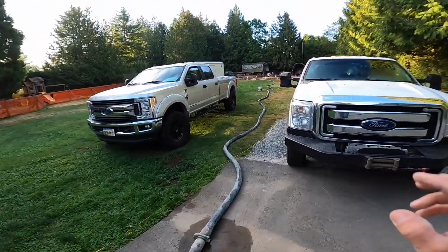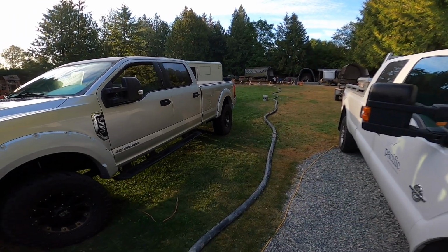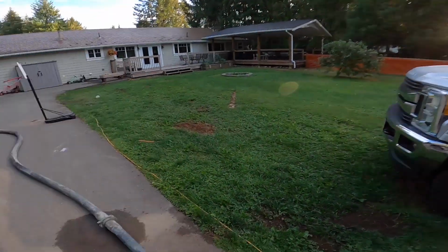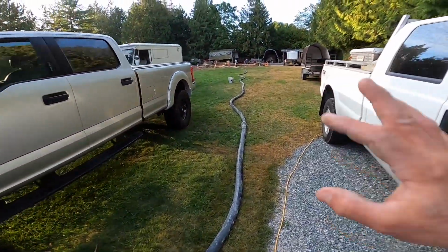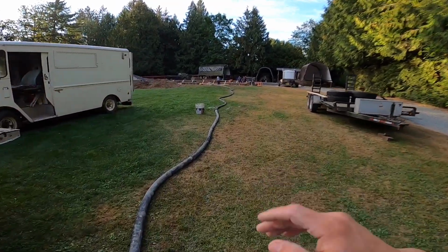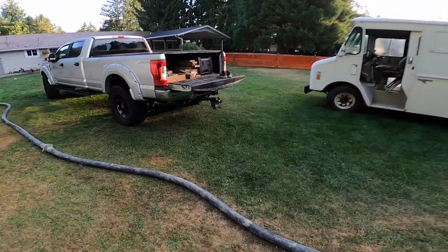As you get closer to the end, he'll start counting off how many hoses from the end of the run he's at. So 100 feet from the end, 75 feet from the end, 50 feet from the end, and so on and so forth. So with 275 feet of hose here, once we get to about 100 feet from the end, we're going to cut that 50 pounds of air probably down to about 35. We're going to use the minimum amount of air that we can while still keeping that sponge moving. That's the key here.